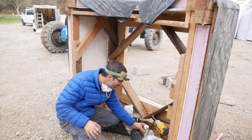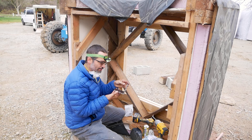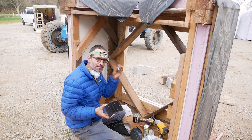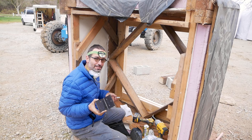For an added level of precaution to ensure that these cupolas don't one day go sailing onto I-70 in a high wind, we're putting these extra brackets on, which we'll kindly drill the holes through very painstakingly with the new drill press. I don't think these can possibly break — we're putting these 3/8-inch hex head lags through these guys, so this will penetrate all the way through the 2x member. I see no possible way that these are getting ripped off. They would have to shear off like 16 of these at the same time or rip the bracket clean off. So yeah, extra level of precaution.